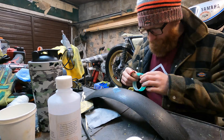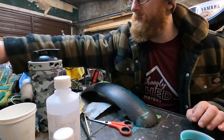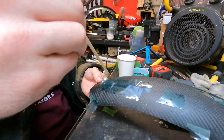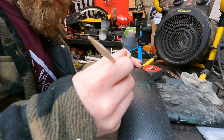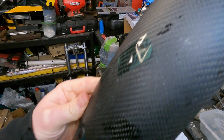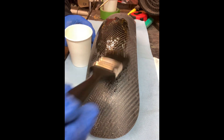Here's some powder coating flash tape I'm using to make dams for the surface finish. I've got some XCR coating resin — I'll put a link in the description — which is used to fill these little blemishes I noticed. Working out the ratios, I use that to fill them, then sand them down and put a few final coats of resin on. You really don't need much at all. The flash tape is quite handy because it just peels right off without leaving any residue and doesn't stick to the epoxy.